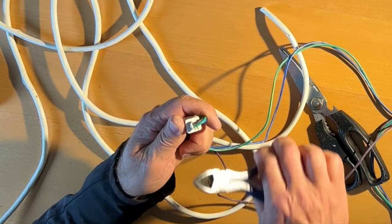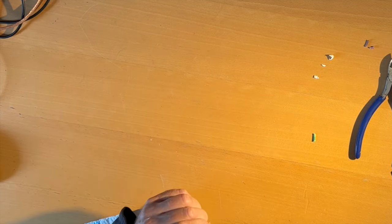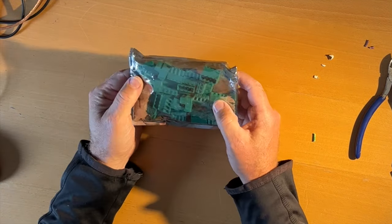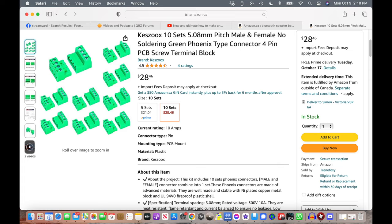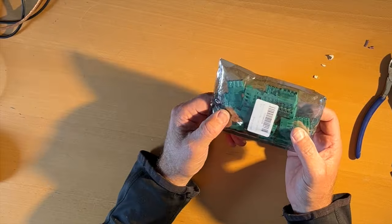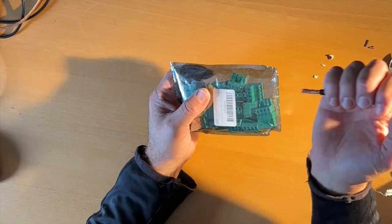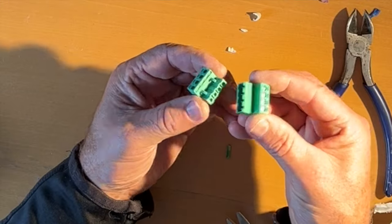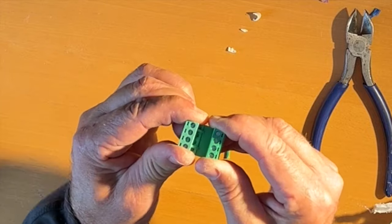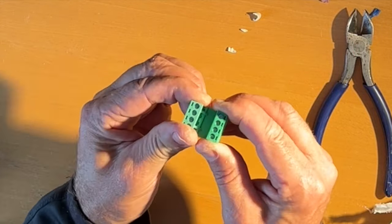I'm going to put a link below for the feed point, and I think you're going to love it. So let's see what we've got in here. Here they are — these are terminal blocks. And what's cool about these terminal blocks is they have a male and a female, which means you can have your PL-259 with a short lead going to one of these and do a quick disconnect. Then you can quickly be changing over dipoles with the other ones. That just goes in there like that — bang. So all we have to do is put the wires in one and the coax in the other. How cool is that?